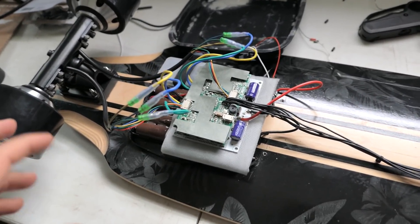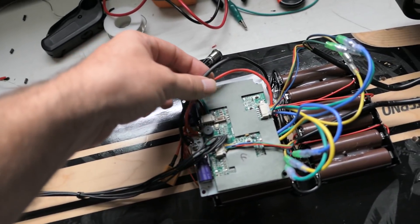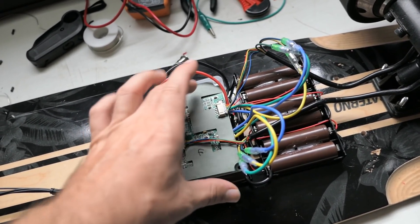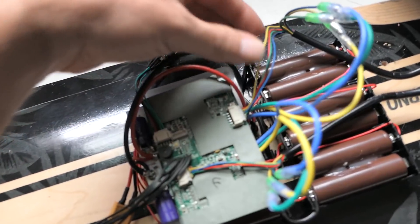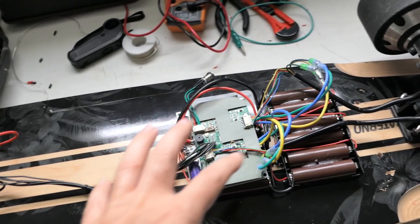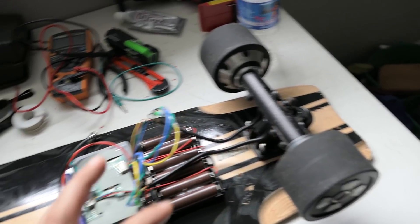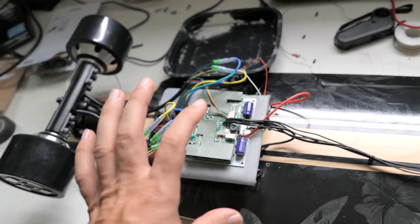Let's go over the details quickly. The batteries are built, then you connect your power to the controllers — that's done. The motor drives need to be connected to the controllers, and that's done with all these wires here. These extra plugs are the hall sensors for the motor. Without those sensors it'll still work but it'll be louder and less consistent. These controllers are made for exactly these motors, so it's a perfect match.